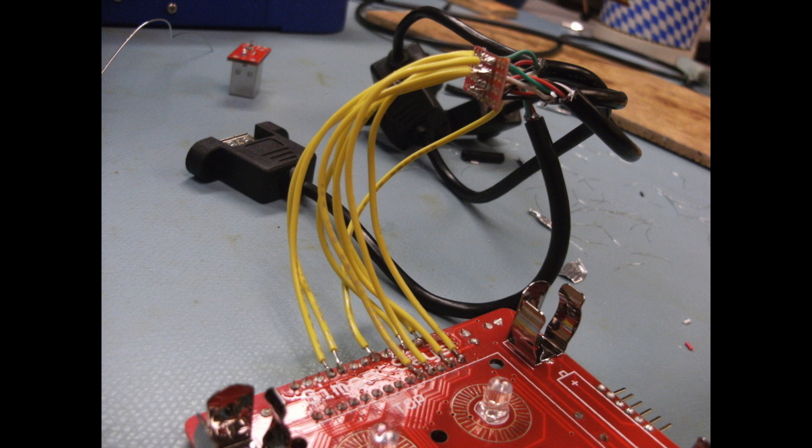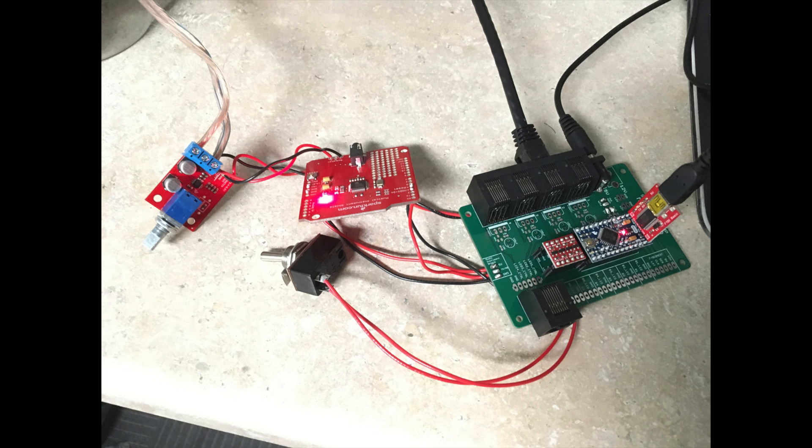The original installation also had a ton of hand soldering on the Simon Says kit where I was wiring to each individual point. For this next one I designed a custom circuit board based off of the Pro Mini, but it breaks everything out with nice labels so I could more clearly keep things organized and know which I/O I was using for the buttons and for the trampolines.